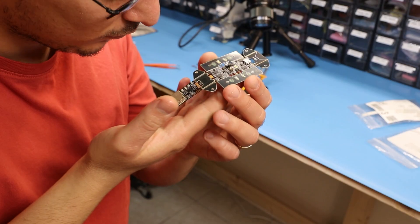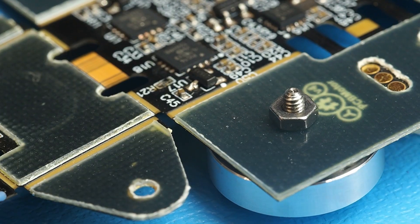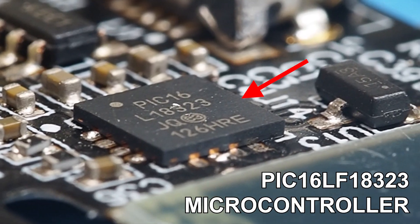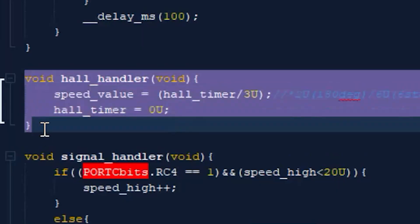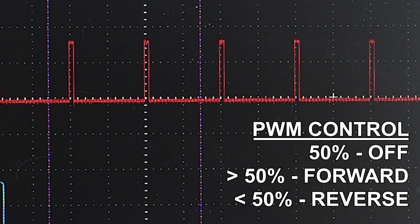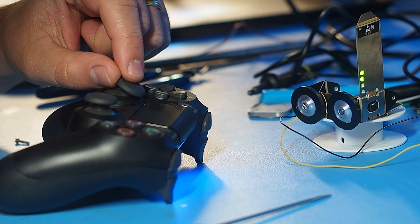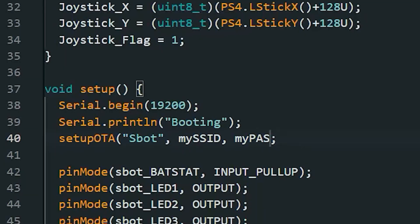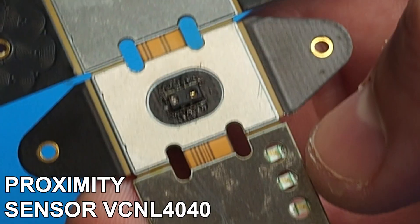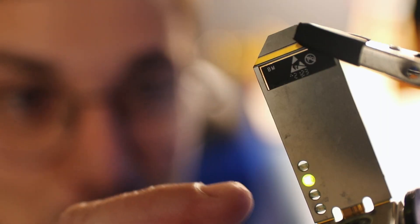Just like that I had an assembled PCB. Let's take a moment to explain how the electronics works. Each motor has a speed controller consisting of a three-phase driver, a PIC16F microcontroller, and a Hall effect sensor. From the sensor, the controller can read the speed of the wheels and regulate the motor's commutation frequency based on the desired speed it receives from the ESP32. This module will be connected to a PlayStation joystick via Bluetooth and will use Wi-Fi for over-the-air programming.